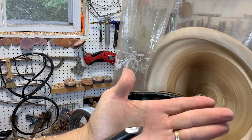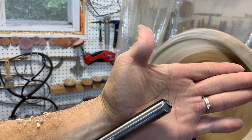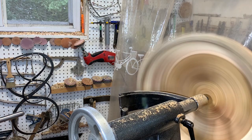The two gouges I use on the inside are a 55-degree swept-back bevel, and then as I get closer to the flat part of the bottom I like to use a 60-degree bottoming bowl gouge, which has much higher, steeper sides on it.